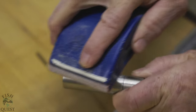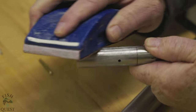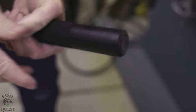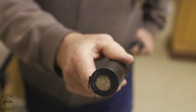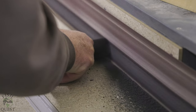We are about to assemble the rod extension, but before we do that we need to sand or buff up the stainless steel pipe fittings — be careful not to remove your markings. The next step is probably the most nerve-wracking part of this build: we need to cut into the bottom of the Ugly Stick. This can be achieved with a hacksaw, a sander, or even a miter saw; we have access to a wide belt sander so that is what we are going to use.